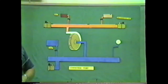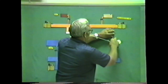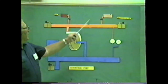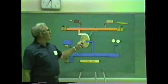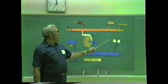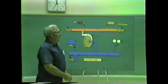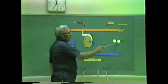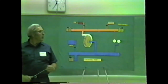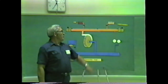Our second master gauge is the pump pressure gauge. It tells us the pressure of the water inside the pump that has been built up and is ready to be discharged. Since it's showing what's ready to be discharged, it must be plumbed into the discharge side of the pump. The pump panel gauges may sit side by side, but they're plumbed into different areas of the pump and show you different things.